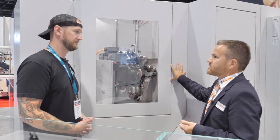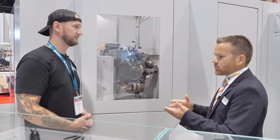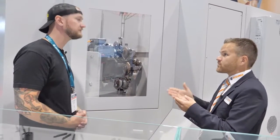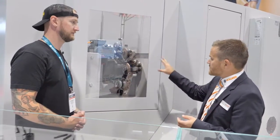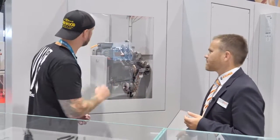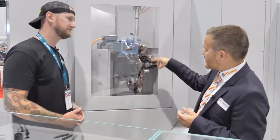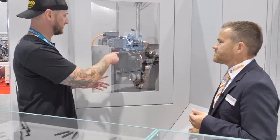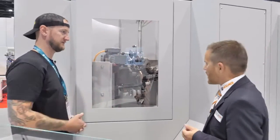So literally when we're looking at one of these copper wheels, it can detect how much it has eroded, redress it, and recalibrate it all automatically? This is controlled by the operator. The operator decides — maybe I have a tool with 10 cutting edges, and after five cutting edges I want to refresh the profile of the wheel and the calibration of the machine. This is then done by the machine fully automatically. So that's eight wheels here plus the two in the machine, and they switch out both the top and bottom spindles.